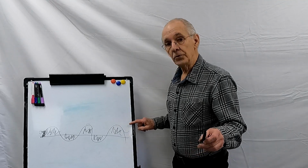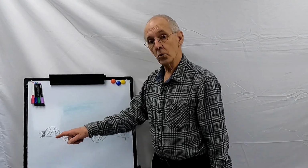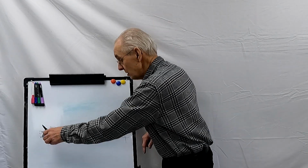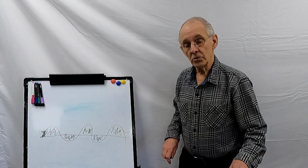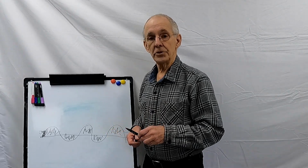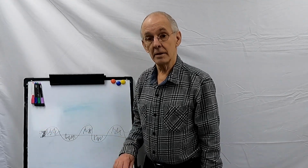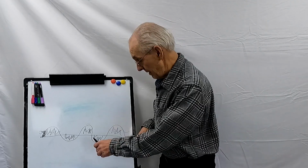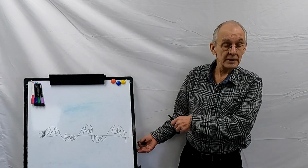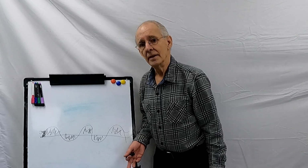And because the fuses are intentionally designed to limit the current, but also allow motors to start and stuff with 6 times the normal running current, this is a huge amount of energy. So the reality is, that sub panel you're working on in a building that you think, oh, how bad could it be? Can be really bad due to the fact that you can get way above the peak limit and get many, many cycles. It might be 20 cycles before something trips. That's an enormous amount of energy, just enormous. It's like a bomb going off, okay?